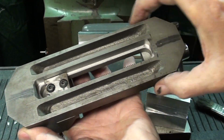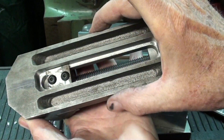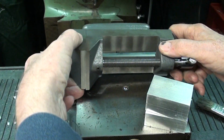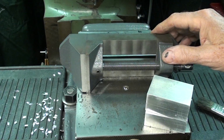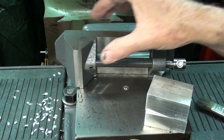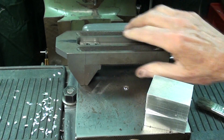Be careful when you handle a cast iron piece like this. If I were to grip this in, let's say, the bench vise for some kind of operation or layout, it could be squeezed and cracked. Cast iron is very brittle, so that'll be laid in there like that, and I need to have some way to clamp this rather than on here, because this is not the same height.